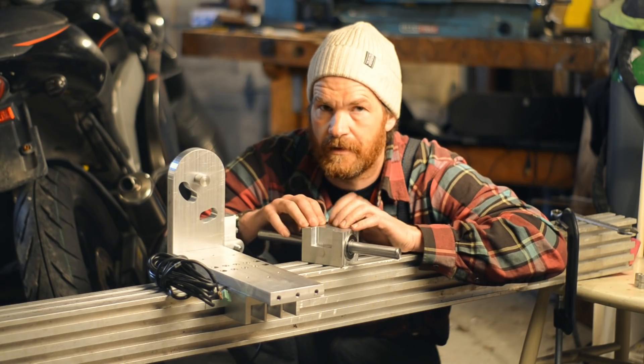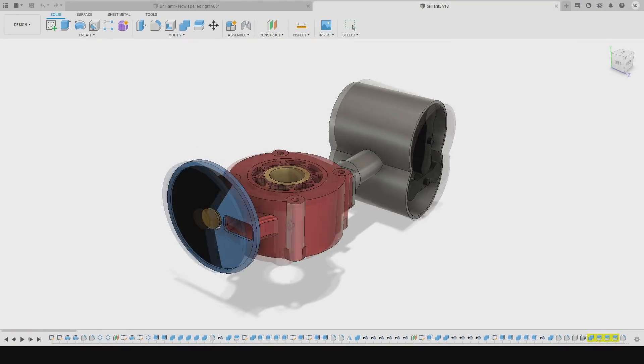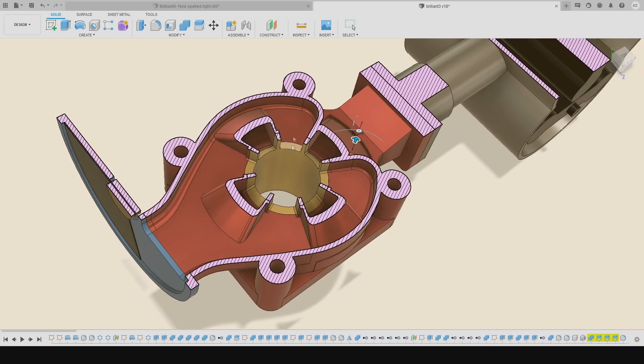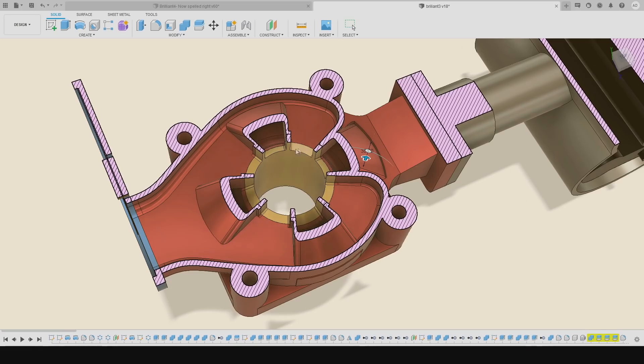Maybe except for the sleeve. In the previous video, you saw the prototype engine with a blower and a rotary exhaust valve — a disc valve — four symmetric exhaust ducts and four symmetric transfer ducts. Here are the exhaust ducts and ports, and in here are the transfer ducts. What I think might become a problem with a design like this is too much mixing of spent and fresh gases, because the ports are intertwined. So — new design.